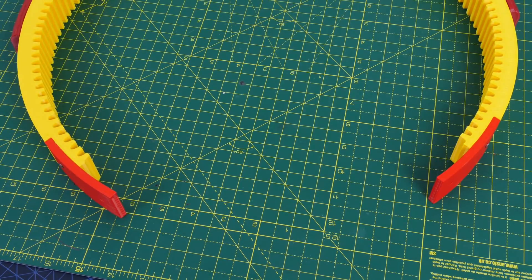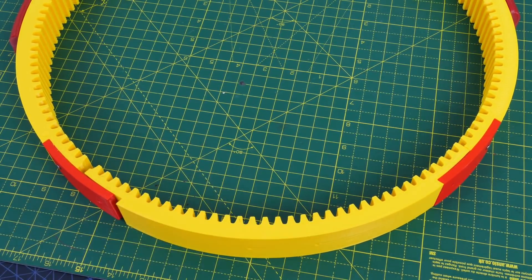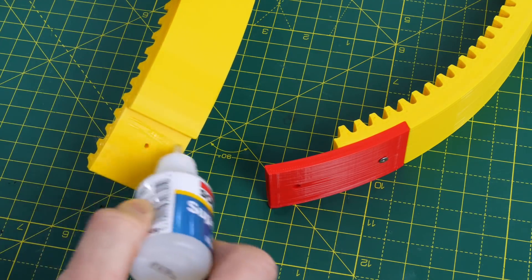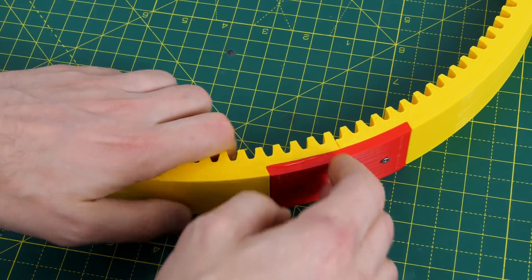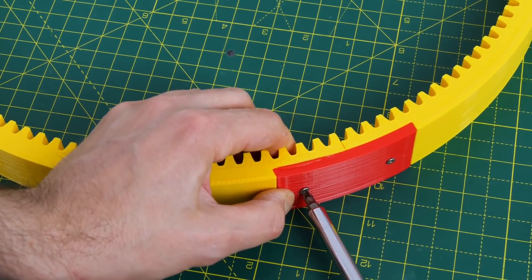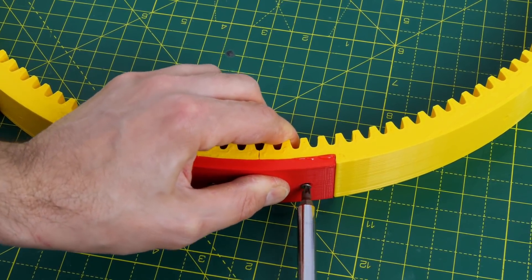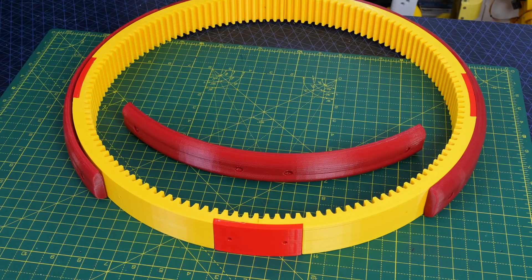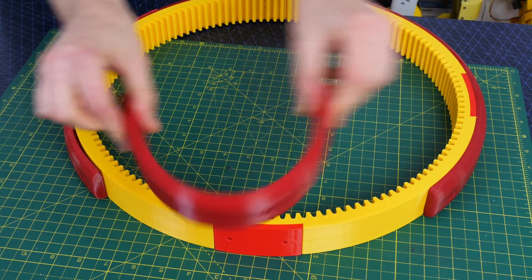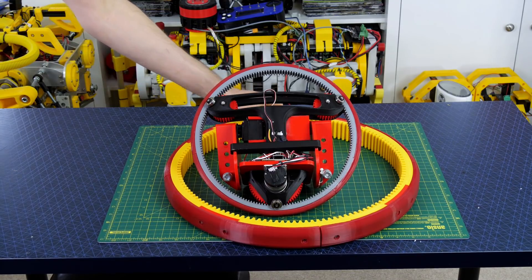The track for this one is pretty big so it's made in multiple pieces. I've made these little recessed tabs which I'm super gluing on and that's going to bridge the gap to make that nice and strong on the seam lines. I'm also screwing them in while the glue dries and then removing the screws again once it's set up because the superglue should be more than strong enough. I've got a TPU tyre which again is in four pieces and that fits on and it's screwed on all the way round.